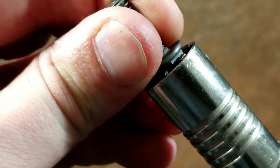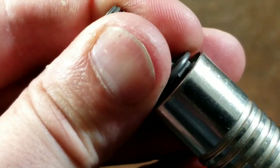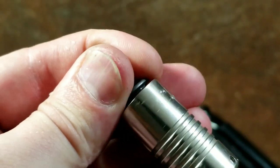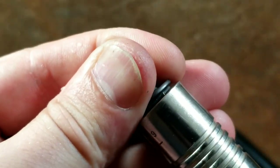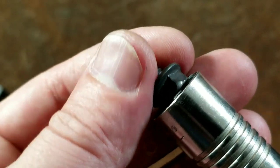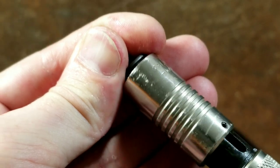There's a little shelf inside that hits the head of the fastener — you just press it on and you're able to turn it. Since this is a 3/8 driver, it only goes from about quarter-inch up to seven-sixteenths. You just press it on and turn. It's really pretty nice — it seems pretty easy for it to catch onto the flats. The little arcs inside the teeth just slip if you're on one of the high spots and you don't really feel it.